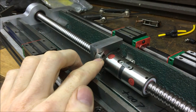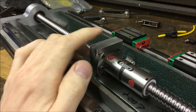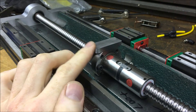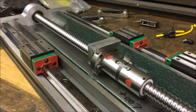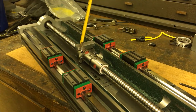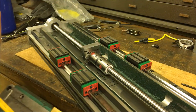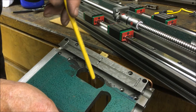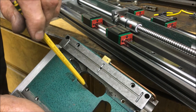This nut was already cut — I suspect by the Chinese, I'll use that term loosely — these were cut for a standard dovetail Grizzly table. I think you could avoid this by not cutting the ball nut flat across the top, because then you would have more bearing surface, and I think it's an important place to have as much bearing surface as possible. Remember, this is where the nut's going to bear on the saddle casting. As you push with these two screws, you push the retainer forward and it pushes on this surface here — and this was a surface that was lacking because we raised the table.